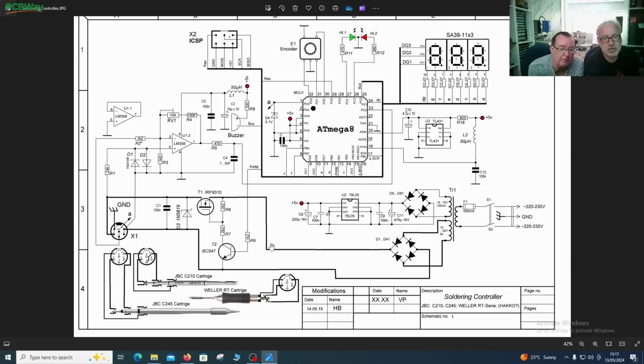Oh, look at this. The circuit completes here. It's a PWM, exactly. So we're driving the T2 with the PWM to give it a bit more power, and then hitting T1 with that. And we probably can go for IRF 9310 or something. This is a generic MOSFET.